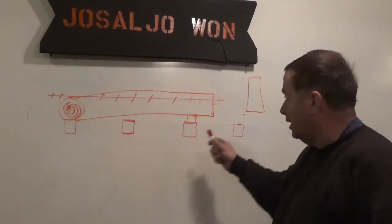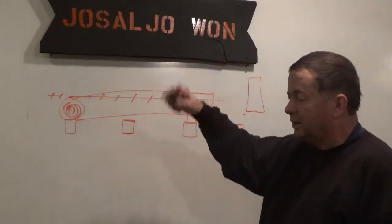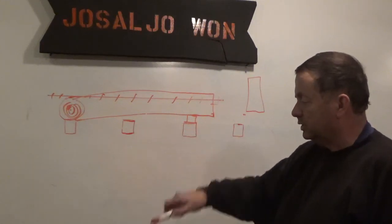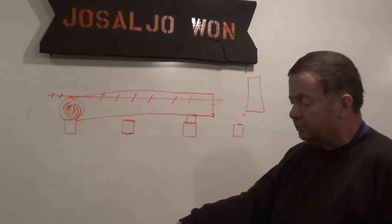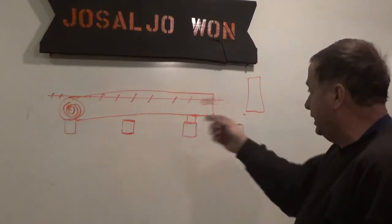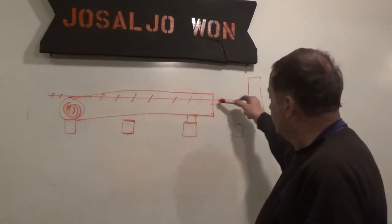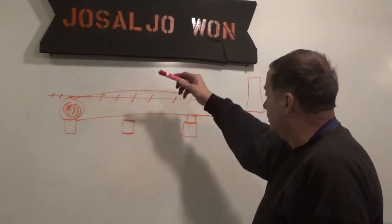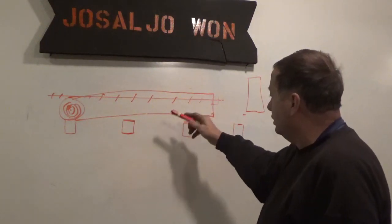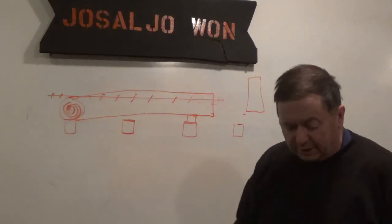So I hope that this helps you to understand whether you need a toe board or not. When you make your cuts with the Woodmizer, if you cut and you turn that cut down, the next cut will make you a parallel cut with the cut you previously made. That's just the nature of the Woodmizer. It cuts straight cuts, okay? And even if the log is bent like this, once you cut it and you roll it over with the flat side down, you don't need any toe board, and these will be flat to one another. I hope you understand that.